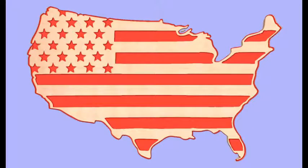One option I could do in this case is, since the height of this particular flag is only 15 inches, I could rotate it 90 degrees and it would fit on the x-axis, but it wouldn't fit on the y-axis still. So I do need to come up with a way of being able to machine on the Machinist CNC.